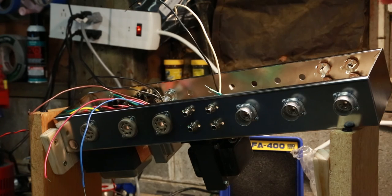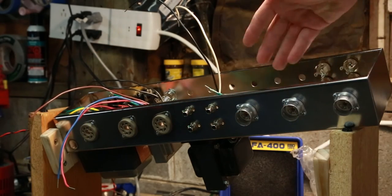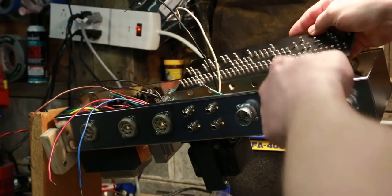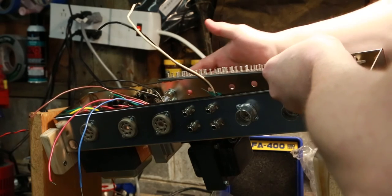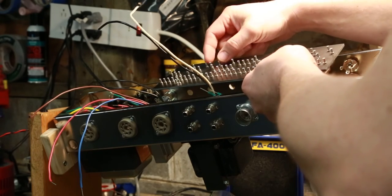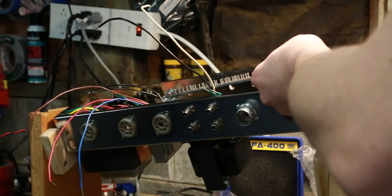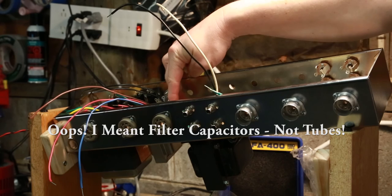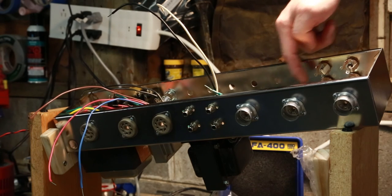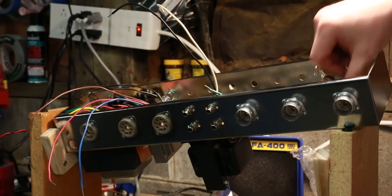My next steps are going to be to hook in power, connect it to the switches, and then populate this board separately before dropping it in and wiring it up. Once you put the board in, you hook the top end up near the power tubes and the bottom end near the potentiometers, which will go in here. This is the power rail along the bottom — you hook the subsequent filter caps here, and the main ones connect where they're coming in from the rectifier. That's also my main grounding bus — it runs down around here and over, and we pull grounds off the turret board as well.